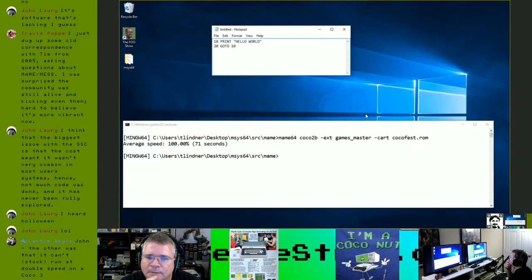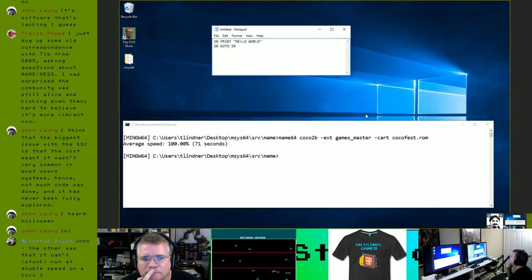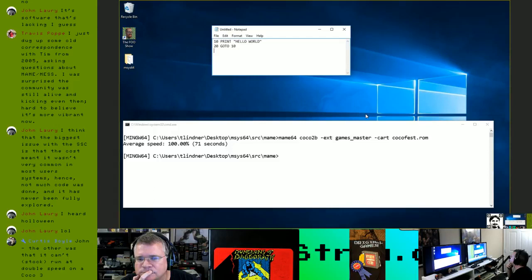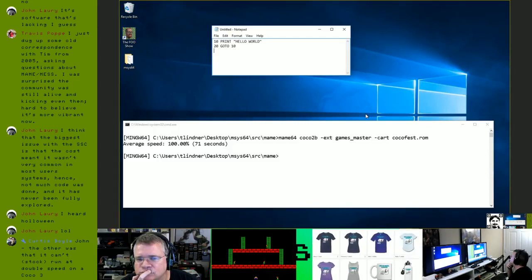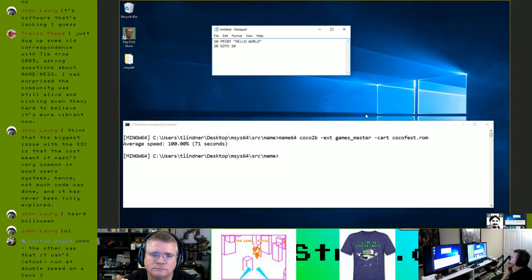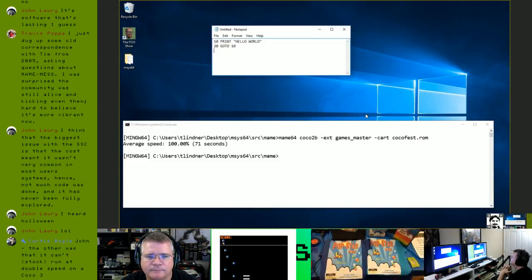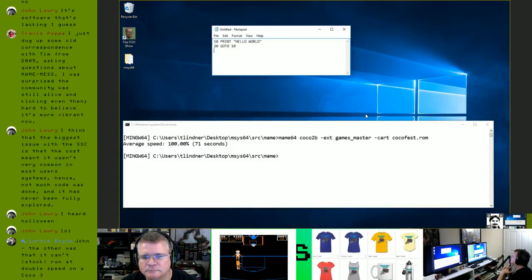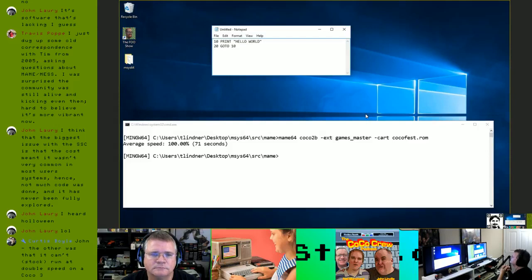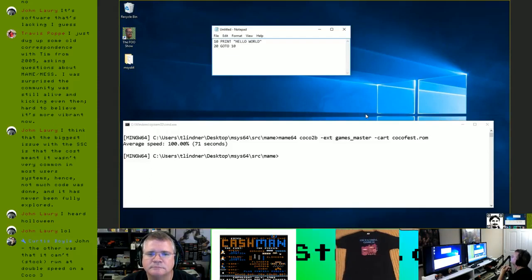Well, if I were to port this to the FPGA, I would do it in a high level manner where I took the instructions that the speech sound pack knew how to do, and I would write my own implementation in the FPGA. For instance, there's a command that says take the next 24 bytes and put it into a buffer. And of course, that's already written with the microcontroller. But if you wanted to push that to the FPGA, you would just intercept the command and do it in its own way, in an FPGA way. Okay. It's not a super complicated device, and it can be emulated in a high-level fashion so that you don't have to create a brand new CPU core to take care of all of the functions that it does. Okay. Because of course with FPGA you have space concerns. You can only have so many CPU cores in an FPGA chip.